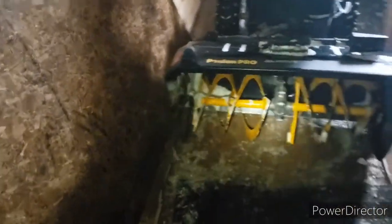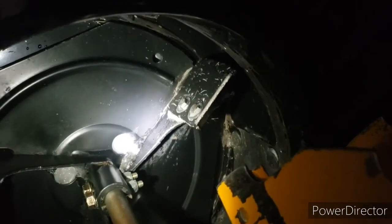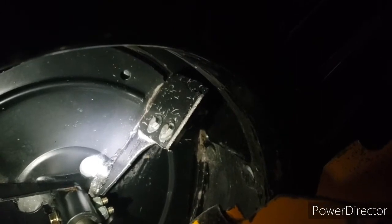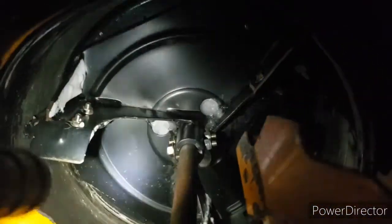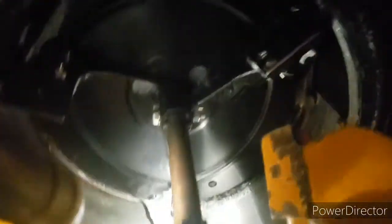What I'm talking about here — can you see the two bolts and the rubber? I got that rubber off a mud flap from a huge vehicle. It's very hard, thick, but flexible. I put one of these on every paddle or fin. I put Loctite on there, put the bolts on, and set about a 1/16 inch clearance from the paddle to the housing.